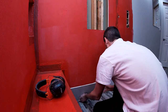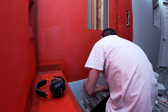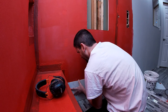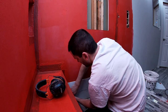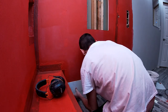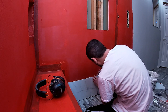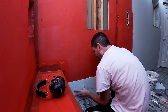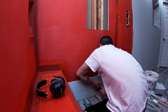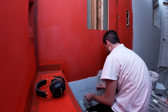For my second tile I chose to back butter it. I go back and forth — it depends on what's easier. If you're doing a big wide area, buttering the walls is usually easier. When you're doing these little end tiles, just putting it on the back of the tile is cleaner and easier. As I said, the floor joint is the one that if something's going to be screwed up, needs to be the one that's screwed up. The following sides around the bench and the jacuzzi side came out much, much better.